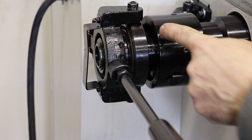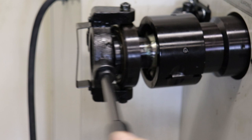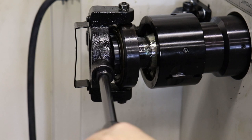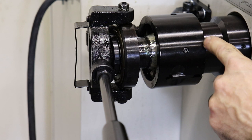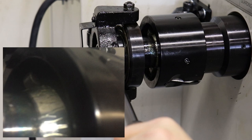There's a cam lock which keeps tension pulling on the 5C. So I don't have the 5C screwed in far enough because I'm not feeling that cam lock, where basically this disc, there's a cone shape and spring-loaded wheels inside of this structure that will actually pop and hold. It'll pop past the top edge of a cone-shaped steel bore or mandrel inside of here. So here now I can start to feel that the rollers are riding up on the cone. So the tension is increased.